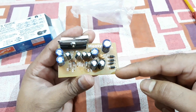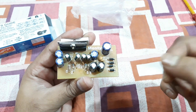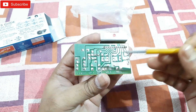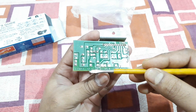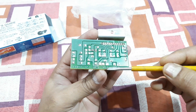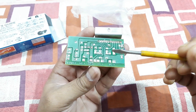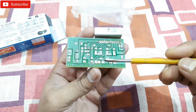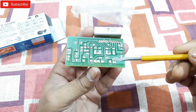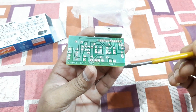On this side you can see the capacitor and diodes — that's the power supply section. The PCB is marked with all the stuff you need: speaker 1, speaker 2, VC1 for volume control 1, and VC2 for volume control 2. Still, if you don't have much electronics knowledge, finding the other wire connections can be a problem, so I'm going to show you how to do that.